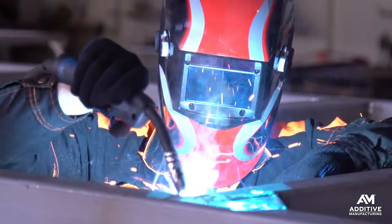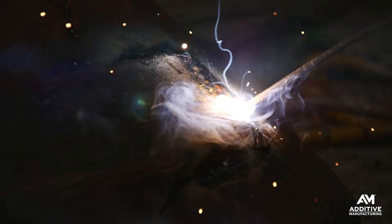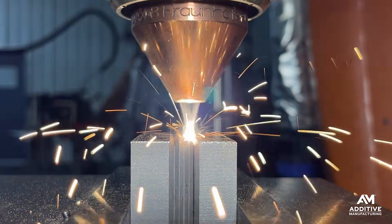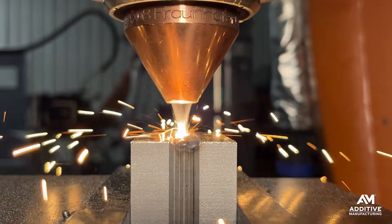One thing you might be wondering is why laser cladding rather than welding. With welding, you melt part of the substrate as well as the filler material, which can lead to a large heat-affected zone, introducing porosity or distortion. With 3D-printed parts, it can also exacerbate residual stresses from the printing process or initiate new stress sources, leading to fatigue cracking. With cladding, a precise laser beam melts just the surface of the substrate to bond the metal wire or powder onto it — resulting in a much smaller heat-affected zone, less risk of distortion or porosity, and a microstructure more similar to that from the 3D printing process, making the joint more uniform and less subject to fatigue cracking.